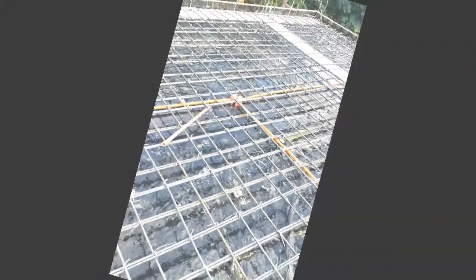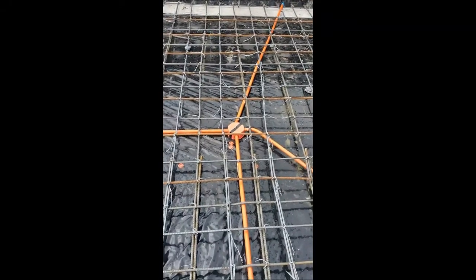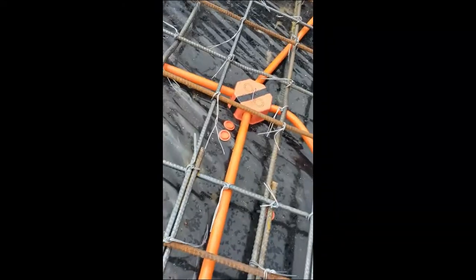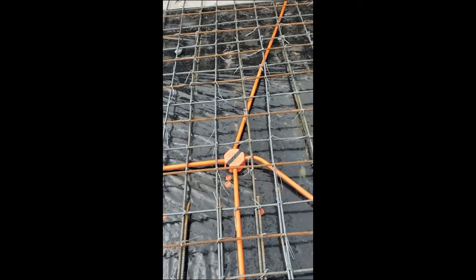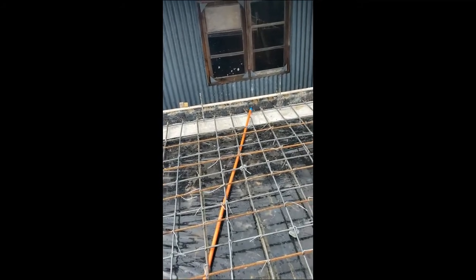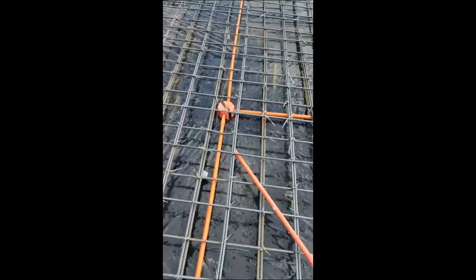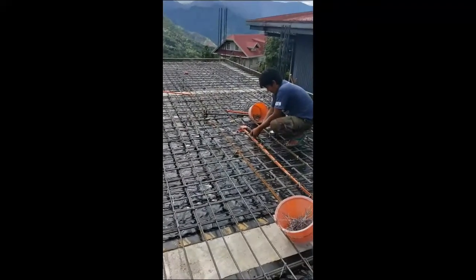All right. So this is what we are doing. Give you a better look now that we actually have some going on. There is the junction box where a light is going to be underneath that. And then we get the pipes that go into the holes there. That way we can run the electrical cables through the PVC pipe, since the floor is going to be cement. So we got going out to the outlet there, this one that bends to go over to the outlet there. We got this one that comes around here, goes to those junction boxes, outlet there, and then coming back around. So we've still got several more to go. Here's Jason working on that.